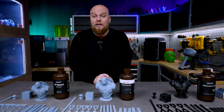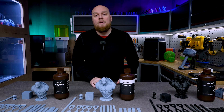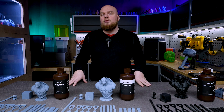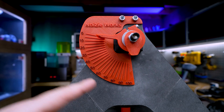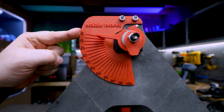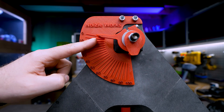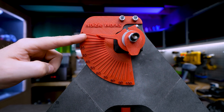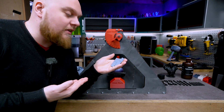First findings: the High Speed resin seems to be high precision too. The Standard Pro shows fairly low warping, which is nice, and the Engineering Pro is still to be seen whether the print difficulty will reward you in performance. Now we are going to start with the impact testing. The impact testing is on a scale of 0 to 100 — 0 means nothing was absorbed by the resin and 100 means a dead blow. From the previous test, one resin performed around 4%, so let's see if these do any better. We'll start with the High Speed.